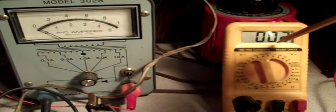All right, here we go. We're going to watch the voltage come up here. I'll be keeping my eye on the amp meter — I don't want too many amps to be drawn. Then we'll glance over at the multimeter and compare the voltage coming here to that point relative to what's being fed in. Let's go ahead and crank up the voltage. You'll notice we've got a nice big jump there in current. That should come down — and it is.